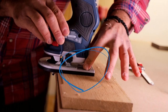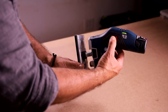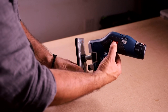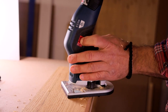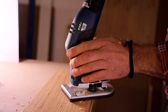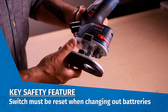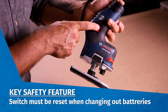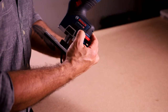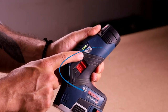There are detents on the base that help further steady the base if necessary. The inset on-off switch is meant to make control easy during one-handed operation using your thumb if you're right-handed. If you're left-handed, it's a little awkward. Functionally, the switch is fine. The thing I like most about it is its safety feature: if the battery dies and you install a new one without switching the tool off first, it won't start back up without you first switching it off and then back on again. It also provides an error code in the battery indicator if the spindle is locked or if it needs to be reset for some reason.